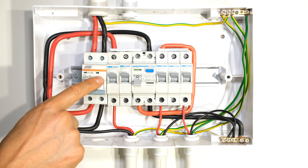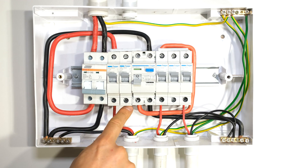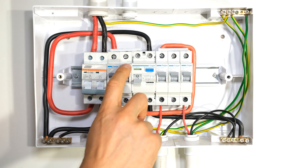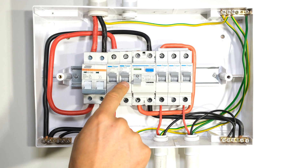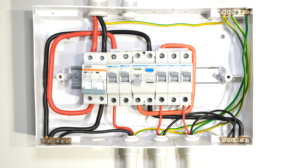So I'm going to install it next to this circuit breaker over here. In this layout I have a circuit breaker here but it is unused, so I have an extra space. I can remove this one, shift the other one up, and install the surge arrestor.